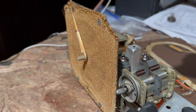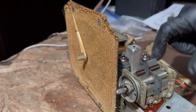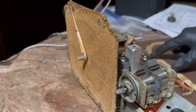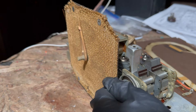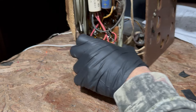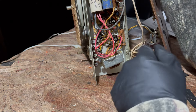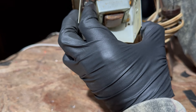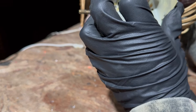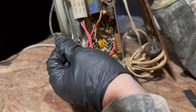I've cleaned the sockets, the phono switch, and the volume/power control, and oiled the tuning capacitor, so that's nice. Now the next thing is a recap. There are at least five paper caps, maybe six — there's one buried down there — plus all the electrolytics. What the heck is this thing here? There's one buried down there too.